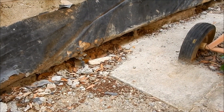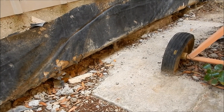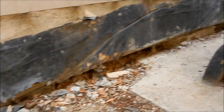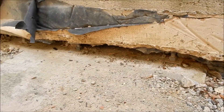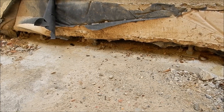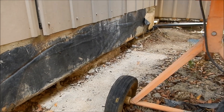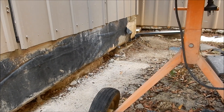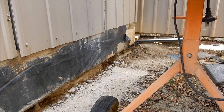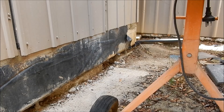You can see underneath there — I did pour some concrete under there but you can sort of see the gap underneath, which is probably around about 90mm or so. It does taper down — it's lifted a little bit less up this side, about a 15mm difference. This side over here went down really badly. You can see on the far corner there how I poured a foundation — I went down fairly deep on that, but as soon as I put the weight on it it just started sinking, hence all the piles.